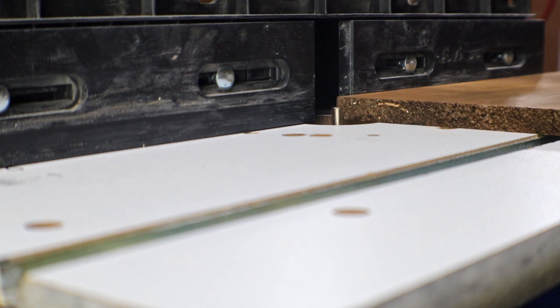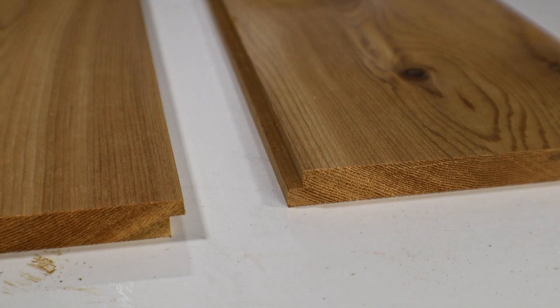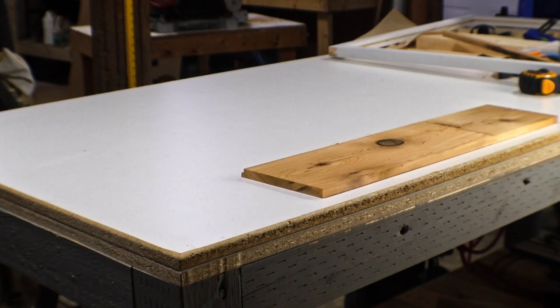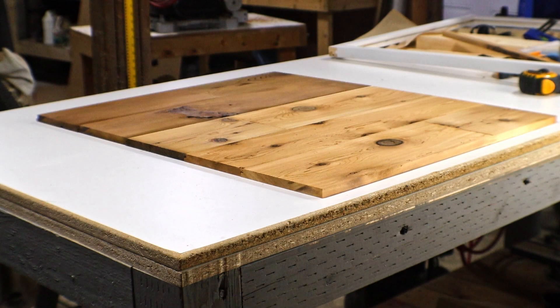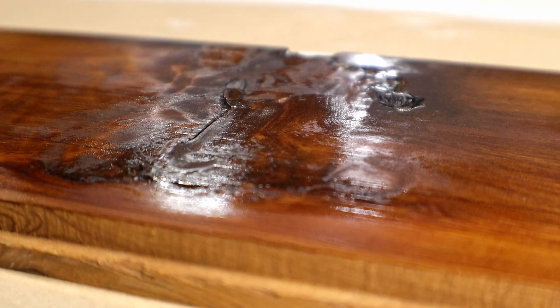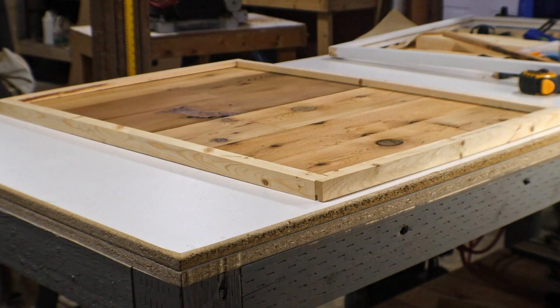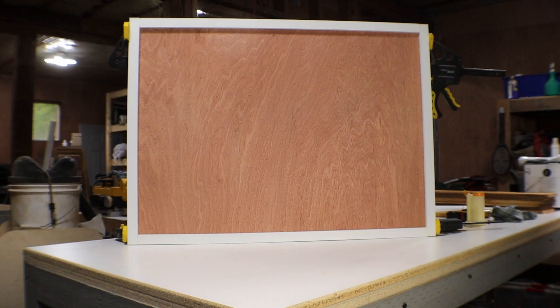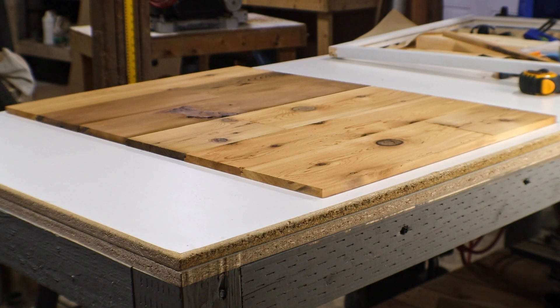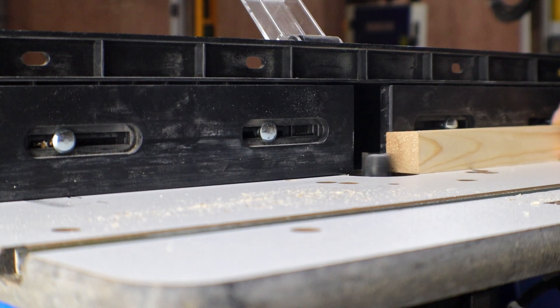I'm going to have these boards overlapping, so I'm going to route out a quarter inch off each side. This will be the side that faces me while I work at my desk, so I thought I'd make it shine a little. For the outer part of this panel it's a bit different than the other side, since it has to accommodate a half inch panel rather than just a three-sixteenths inch panel. So back to the router with a bigger bit this time.